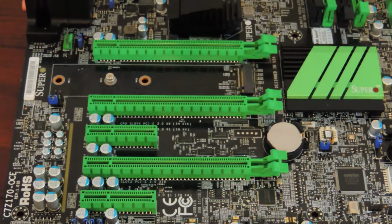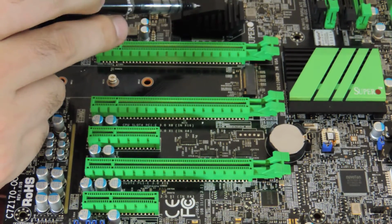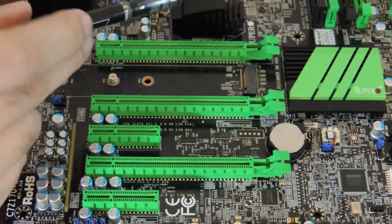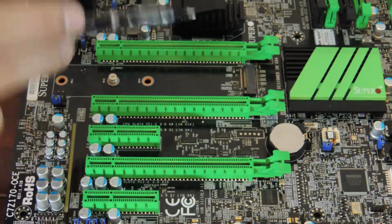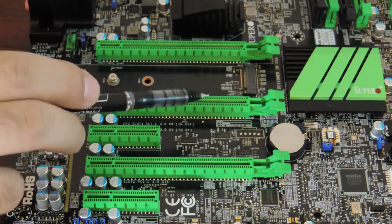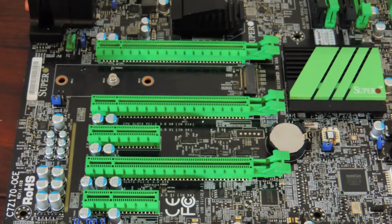So you basically have this slot. This slot is hardwired to the PEX 8747. So this is directly hooked up to this. When 16 lanes come from the CPU to the PEX 8747, it takes those 16x lanes and basically maps them to 32x down here at these 3 slots. The long slots get 32x, but in a pretty interesting way.